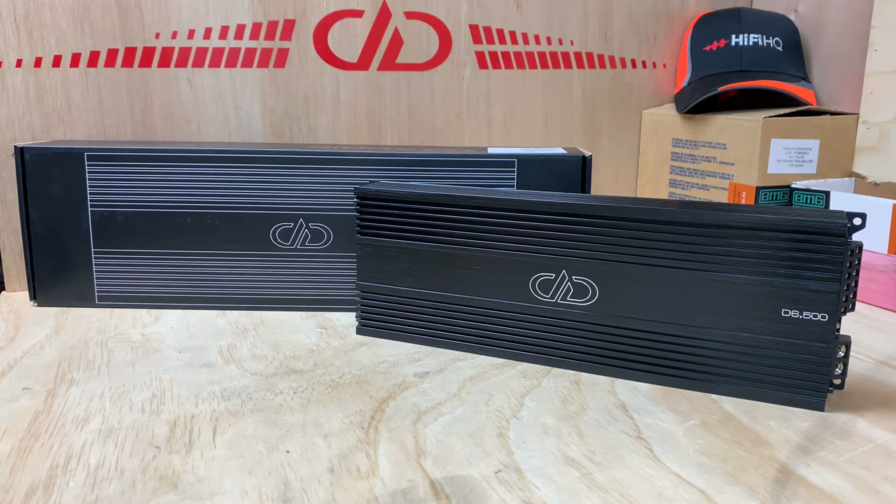Now again, with the power side of things, this is where it gets pretty cool. You've effectively got 6 channels. You can have channels 1 to 4 at 4x100, or you can do 2x320, and channels 5 and 6 you can either drive 200 watts per channel, or you can also mono that at 560. So you could have 100x4 for your 4 speakers and 560 into 1 for your subwoofer. So you could run the whole system off this one amplifier in a very nice compact way.